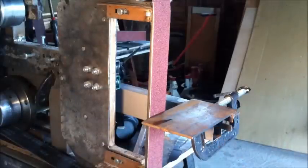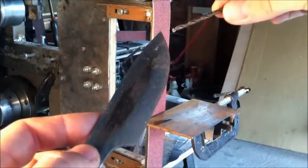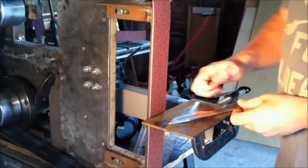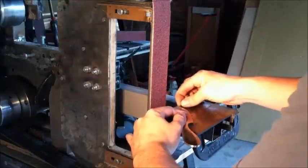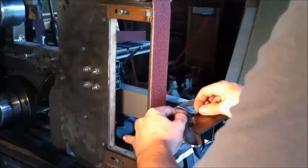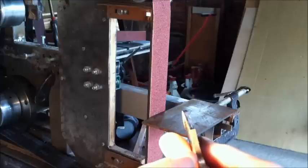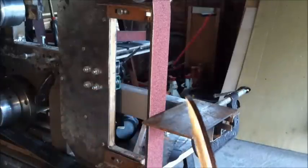Then we're going to take an 1/8 inch drill bit and mark along the side of it, just starting from the tip all the way down. To do this, you're going to need a good flat surface — I use my tool rest, it's really flat. You're just going to take that drill bit and go right along the edge. Make sure you have a pretty nice line that you can see, because when you're grinding, that's your only point of reference. That line across there all the way down is going to be the absolute center that we need to grind to.